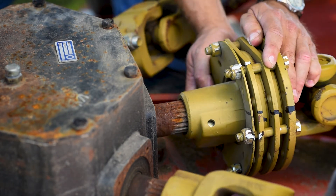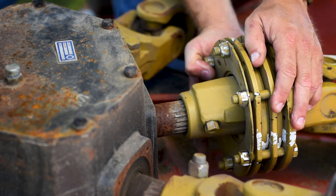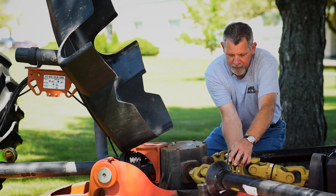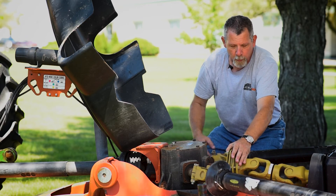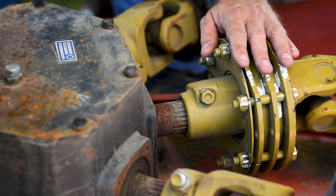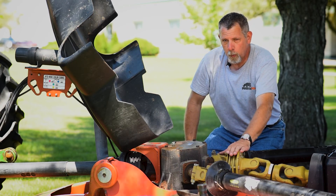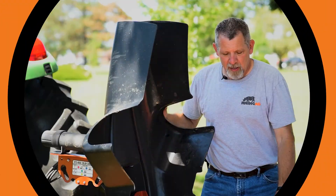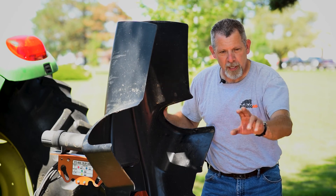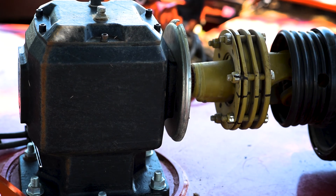We want to take a look and make sure that each of the bolts are adjusted correctly, checking this gap all the way around — it should be equal all the way around, and this one looks pretty good. Once that gap looks equal and our clutch is adjusted with the three turns out, we're ready to go to the field. Once we get to the field, there may be some slight adjustments needed — we may have to tighten it a little if we experience some slippage. Otherwise, we're ready to mow until our next maintenance cycle. Now that we've got this intermediate slip clutch adjusted on this 4155 flex wing, we're going to repeat that procedure for the wing drivelines as well. Each of those have a slip clutch on them and the procedure is exactly the same.